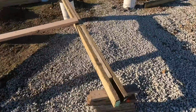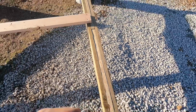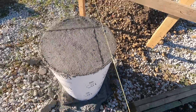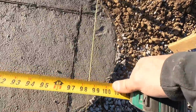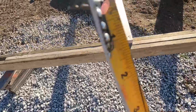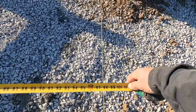We're gonna start framing up this wall. So, got these all notched where the trusses sit using the storyboard. Got all my girt locations marked. So the first thing I'm gonna do is I got my end string line up. That's the end of the building. Got the end of my post sitting in my bracket. Just gonna hook on the end. Measure over 98 3/8. And so to make sure it's square, I'm gonna start on my middle girt and I'm gonna hook on where that's gonna attach and I'm gonna make sure it's 98 3/8.